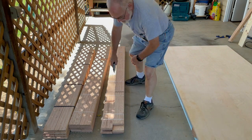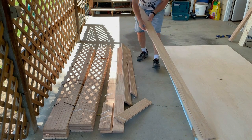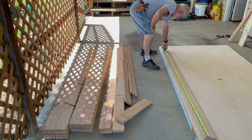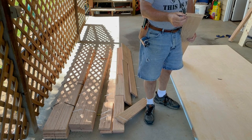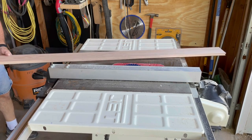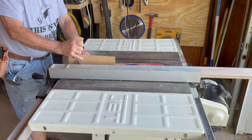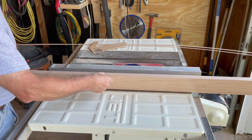The first thing I'm going to do is cut my bundles open and see what lengths I have. I found one full-length board in the bundle — it's 83 inches long. I want the table to be six-six, so this will be my starter board. What I'm going to do is rip the groove off so I have a smooth edge at the edge of the table. I'm going to do that at the table saw, set up to rip this four inches wide — that will cut the quarter inch off and leave a flush side all the way down.